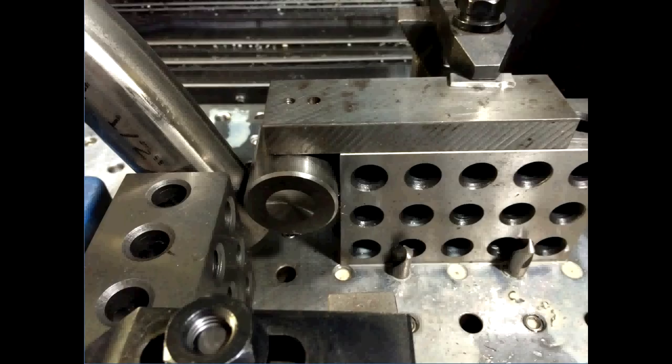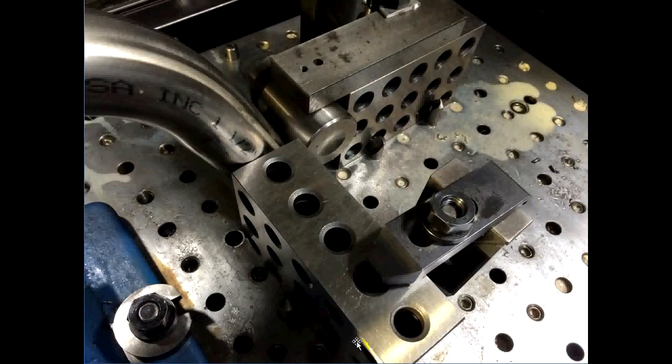In the next slide we get more of an overview. This 2-4-6 block, which is bolted to the table, keeps the pipe perpendicular in the Y direction. We've slid it up in the X direction to have a stop. I've got some pins in here to make sure it was nice and parallel — those pins are a pain to blow out, but they're really nice for setup. I just rotate the pipe in the vise until it is perpendicular, hits the 2-4-6 block, pushes up against this roll, and then tighten the vise.